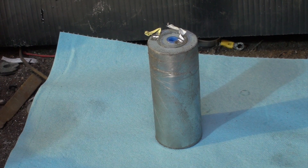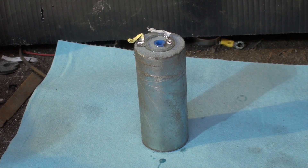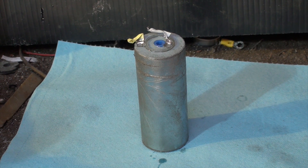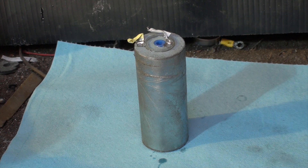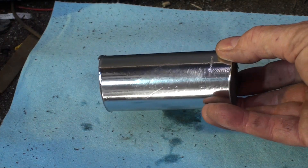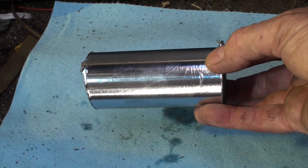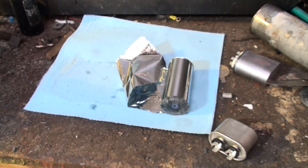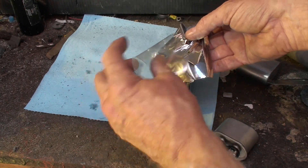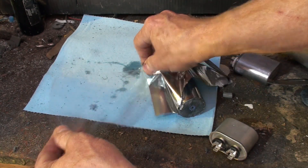Here's what's inside the run cap — a little tube. It's actually layers of an insulating material and layers of aluminum foil. I'm going to disassemble this thing so you can see what it's made of. There's a little plastic coating on it, and underneath that you can see this aluminum-looking stuff, which is very thin aluminum foil. I'm going to peel some of that off and take a look at what it looks like inside.